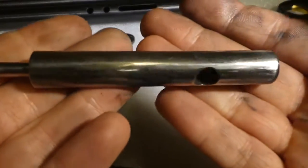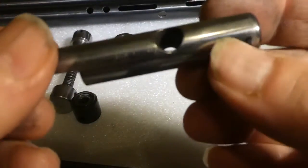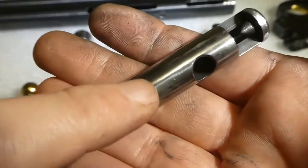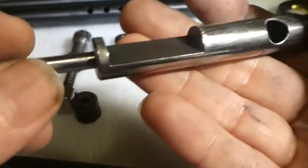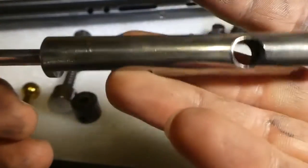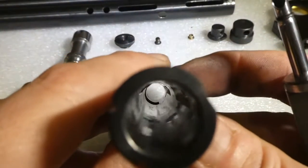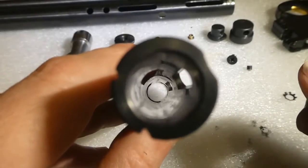With this, a good polish also helps. Tolerances on these guns are not particularly great — as you can see there are a lot of lines inside the bolt. I've polished this to almost mirror but because of the inside of the cylinder it gets marked back up. I've polished it but I don't want to take too much out of it.